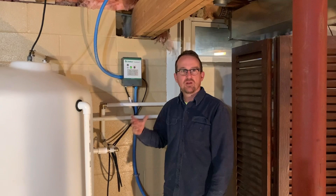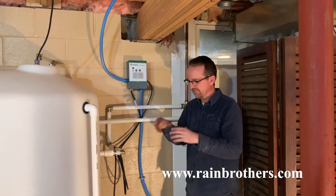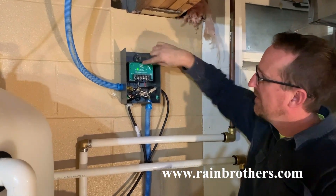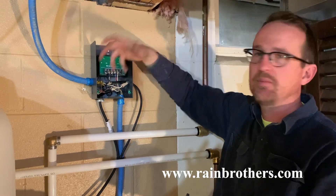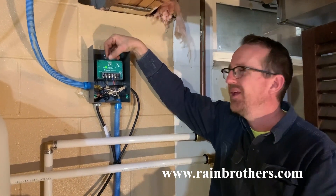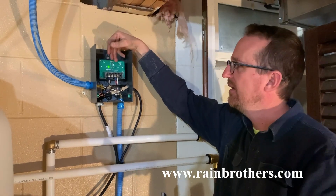The final part of this system is troubleshooting. First, if the reservoir isn't filling as quickly as you'd like, the pump saver is likely shutting the pump down when it detects air being drawn. Note the interval this pump saver is set to — this set screw should be turned to one of the numbered positions. In this case it's set to 160, meaning every 160 minutes the pump saver allows the pump to recycle and try again. You can reduce this to 50 or even 2 minutes, but we generally recommend 160 minutes as a sweet spot to avoid repeatedly running the pump dry.